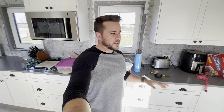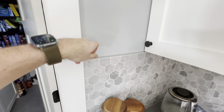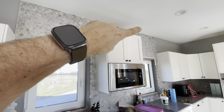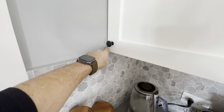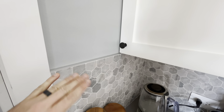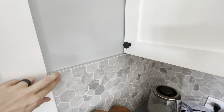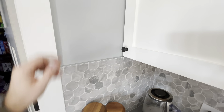The tile is all done and I wanted to touch on some things I skipped because I didn't shoot most of the stuff. You saw me putting up the tile and really the rest was pretty much the same, so I didn't see a need to show most of it. One thing I want to touch on is this aluminum trim here that I used along the edges and up top. I made a line going from the bottom edge of the cabinet and I stuck that right onto the adhesive backing just like the tile. Over top I just cut some thin strips to put back over so the tile still had something to stick to, and then grouted and everything was fine — just like normal tiling.